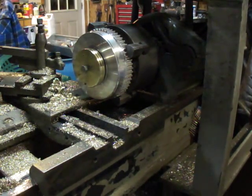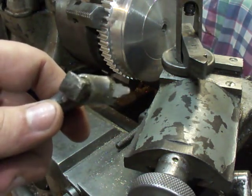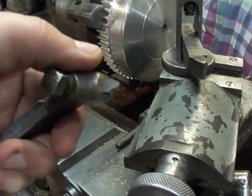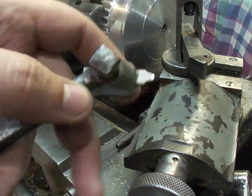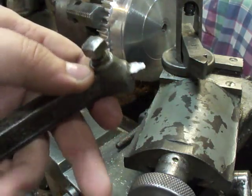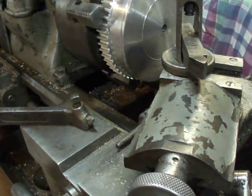We'll see how it fits after I cut some rings. I figured I'd show you the tool I was using for cutting the groove for the O-ring. Since I was going to go with some round tubing, I was using the same profile you'd use for an O-ring. I also have a radius on the side — radius on both sides, straight back. I had a radius so I could run it up against a corner and actually radius the corner. It's just a small radius.